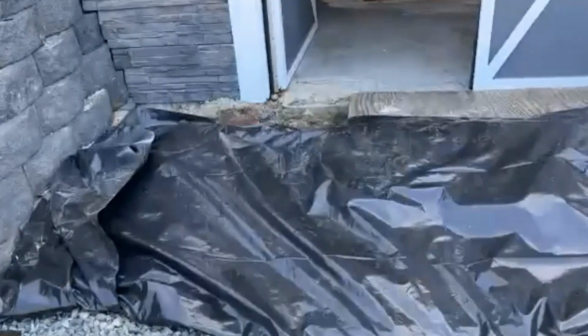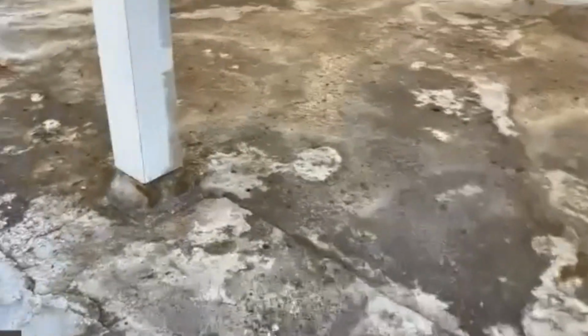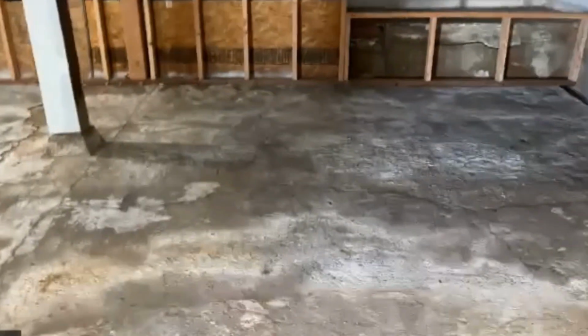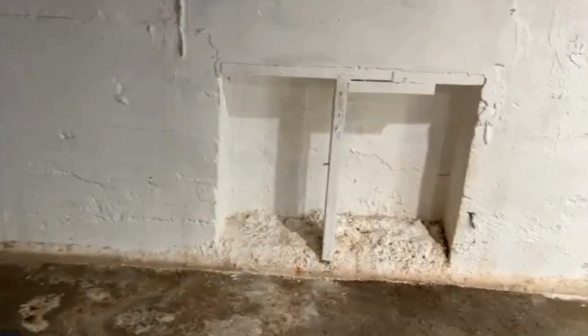And it's nice that she has a gravel driveway, because that makes this a little bit easier rather than having to cut concrete. Inside, if this system on the outside didn't work, you've probably seen or talked to people about cutting the basement floor, and that's fine. That works just the same as the outside. A concrete saw is used, about a foot wide trench, and you cut out a 1 foot section all the way around the perimeter on the inside. Dig it down so that you're at the footer level below the floor. Install perforated pipe and gravel. She's got gravity and it could go straight out. If you don't, it would go to a sump pump, lift it up, and send it out through the wall up higher. But very simple to do.